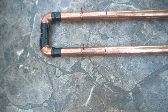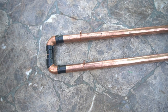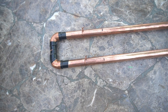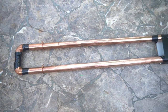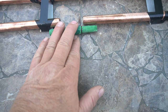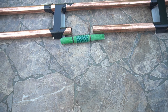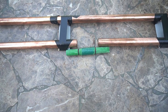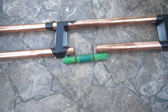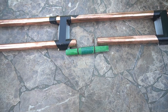When I first tuned it, it was pretty good. I was only running about five watts, and then as I turned the power up I noticed I had some SWR. I got the SWR pretty close to 1:1 on the whole two meter band. I'm going to take this little piece of fiberglass that I made to fit and fit it in between the two spots to keep them where they're supposed to be — I'll hot glue it in. That will also seal these ends so everything will be sealed.